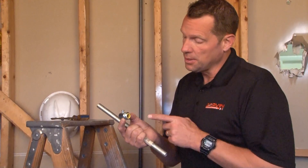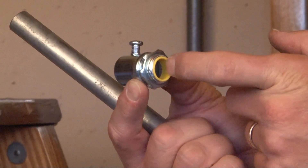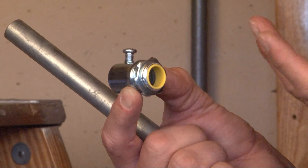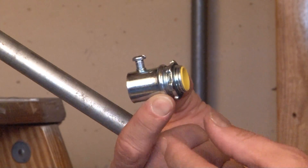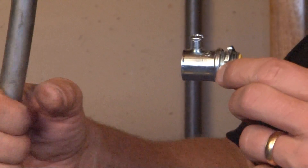The SSCN50i is a half-inch set screw connector for EMT conduit. What's interesting about it is that it has a plastic insulator in the throat, so when you pull the wires through — either to other conduits or terminate them in a box — there's no sharp edge that might scar or cut the wire. It creates a nice smooth edge for your wires to pull through.